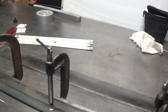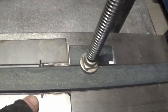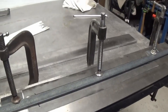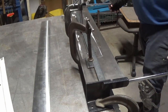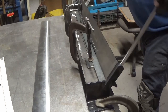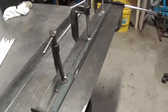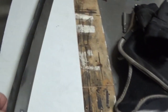Got it all set up in the metal brake. I got it where my lines are right there on the edge — same line as this one. Really all that's left is to stop talking and start bending. Okay, there's the wife — she's playing music so I better get this done real fast, I don't want any copyright issues. But there we go, we got our bend. Now flip it around to the other side, get the other bend. Okay, there we go, we got both sides bent.